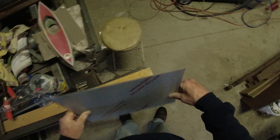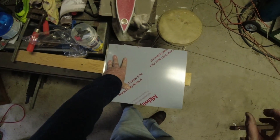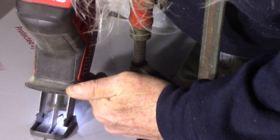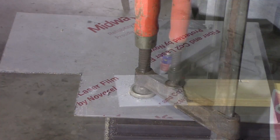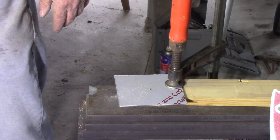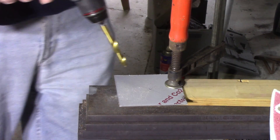This is some two millimetre stainless steel sheet. I've got to cut a round piece out of it and a square piece for the mast — I've got to make a little mast for the GPS antenna, the satellite stabilisation unit. I've just got to cut a square out first so I can then make it round. Unfortunately my big drill press was moved by workers who came out to re-roof the shed, and it got damaged — I can hear sparking as soon as I put power through it, so it's not safe to use.